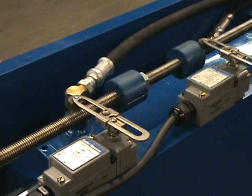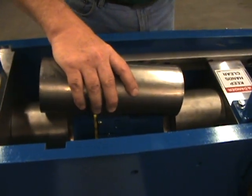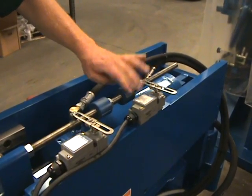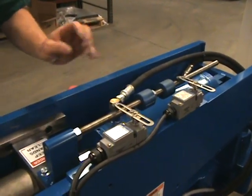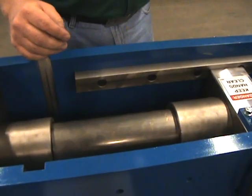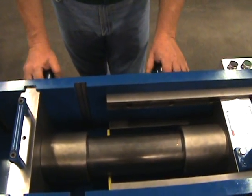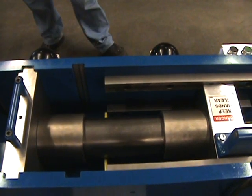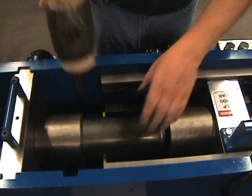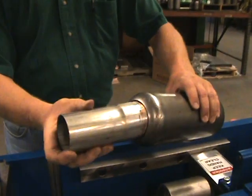And then we'll want to set it up for the reverse motion so that we can just get our part in there. Currently we're too close. So we're going to have to move our reverse stop forward. We'll activate it. And right there I can load it. So I should be set to run this part. Our new part at our new length.